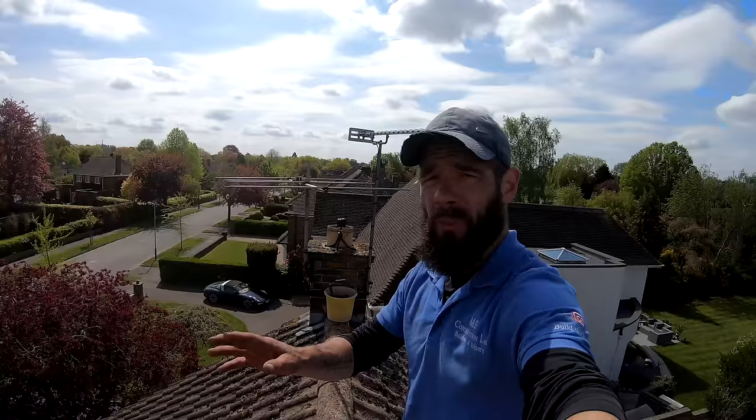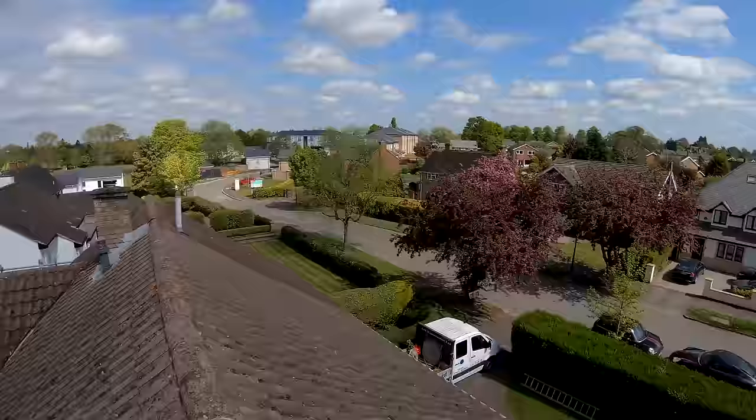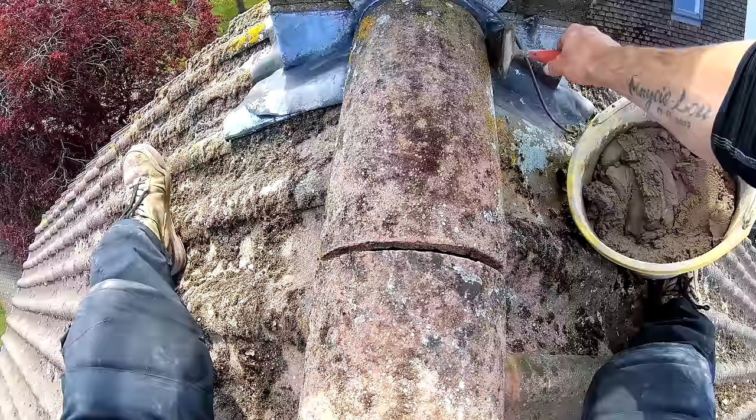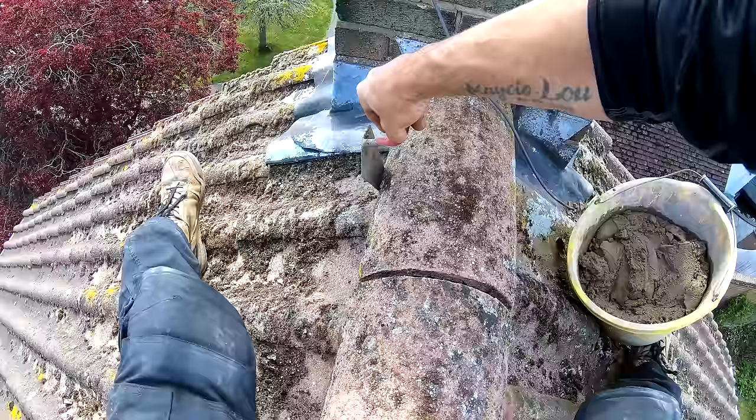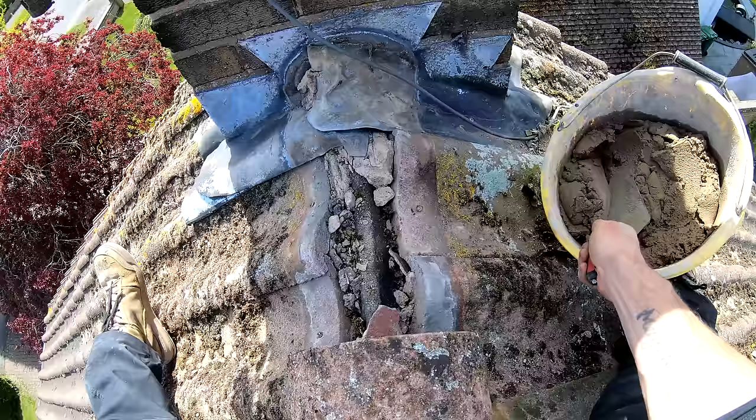When doing the ridges, one of the key things you want to do is start at the farthest end away from the ladder possible, and then work your way all the way down to the ladder. The reason I do that is if I was to go from the end where the ladder is all the way this way, I'd be stuck and wouldn't be able to get down. So the first thing I'd like to do is mark down the edge on my ridge on both sides. If you look, I can see my line coming all the way on the tile — that allows me to know where I put my first line of muck.